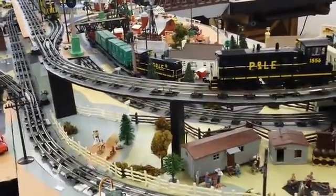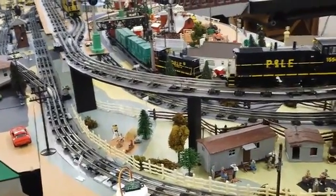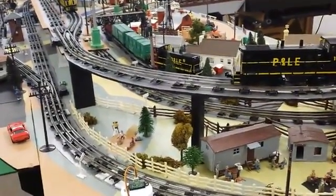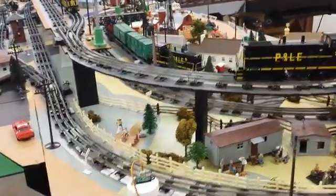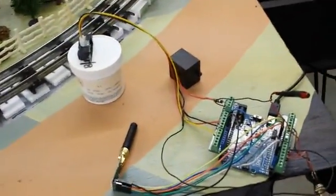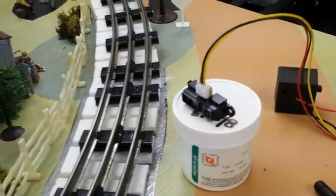Back in the 1950s, you used to be able to do that with just a piece of insulated track and a couple of jumper wires. With the MTH trains, there's really no way to do that with them out of the box. So I took my work with MTH control by radio, added a few extra commands, made the program a little more complicated, and produced a little controller using an Arduino, a CC1101 radio, and something new for me — an infrared detector to detect the trains coming by.